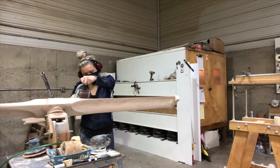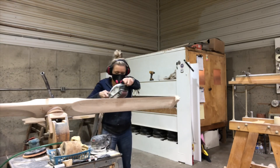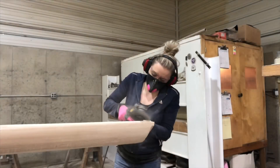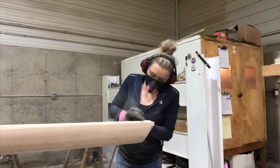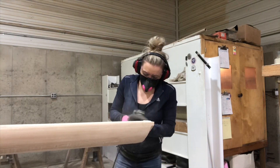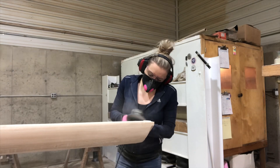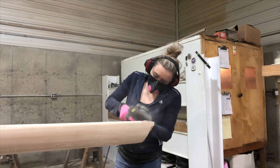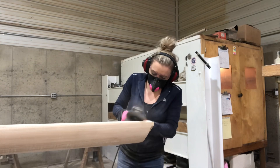The hub usually takes a little bit more work, so I kind of concentrate in that area, whereas the rest of the blade I have to keep moving. This gives you a little bit of a view of how it's concaved there, and that proved to be quite the challenge when we sanded it — it was a little bit difficult. Then I'm using the grinder on the tip there because I had so much material to remove. I have a sanding flap wheel that I put on a grinder and just grind it down — it makes pretty quick work of it.